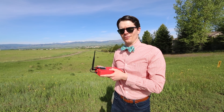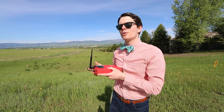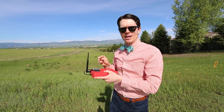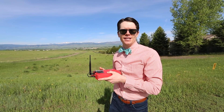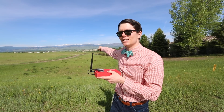We drove uphill from SparkFun, so we still have line of sight to the building. I measured on Google Maps and we're about 1.8 miles away. I'm dropping about 70% of my packets, but that means 30% are still going through. That's pretty good with this antenna, and you can upgrade this even more if you were to put on a directional antenna and be able to increase the distance with LoRa.